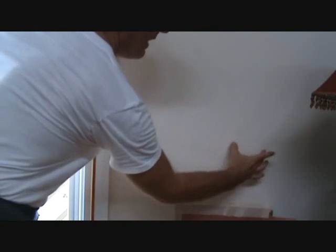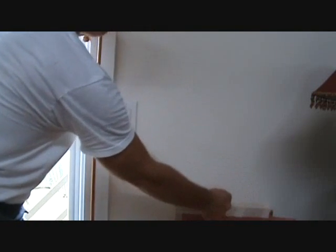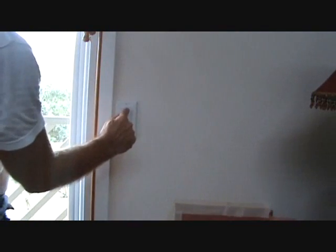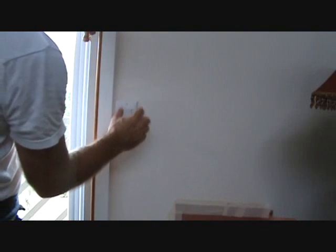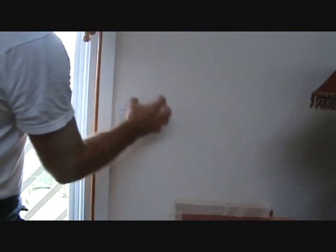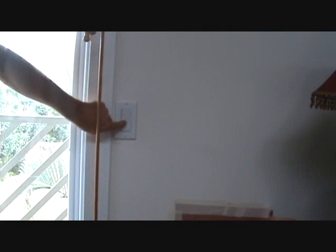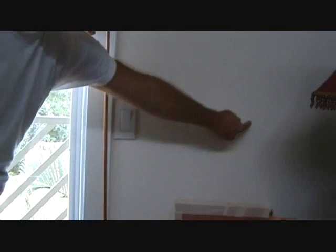There's a 2x4, then the plug. We've got to drill a hole through that 2x4, then we've got to fish a wire from down below over to this location here. So if I take this light switch out, I'm going to cut this bigger — I'm going to put another light switch next to this one — and so there'll be plenty of room to fish some wires down the wall and in through that stud.